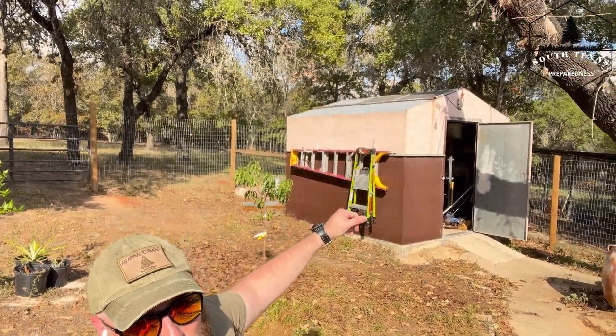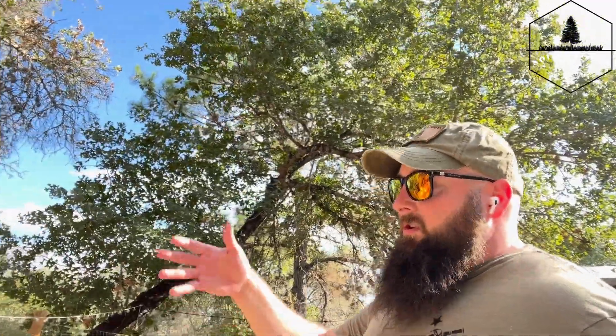You can probably see the panels up there. I went with solar because it's sunny almost all the time and it's silent. I get about 25 years give or take on most of the components, short of the batteries — the batteries are the most difficult part in my opinion. It's also very easy to learn. I wanted to do something scalable, and solar is an exceptional way to do that. As opposed to a generator, you can't stack multiple generators together to create more power. With solar, you can add more panels, reposition them, add more batteries — there are a lot of ways to continuously upgrade your system.